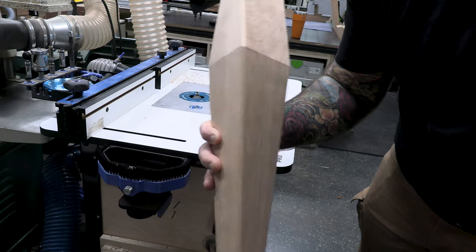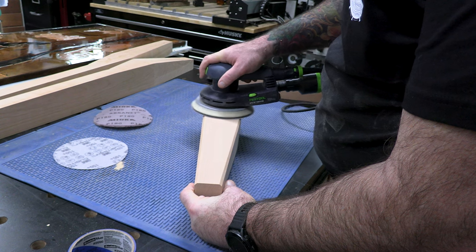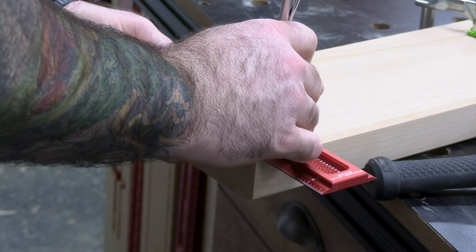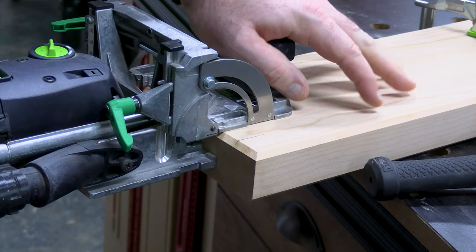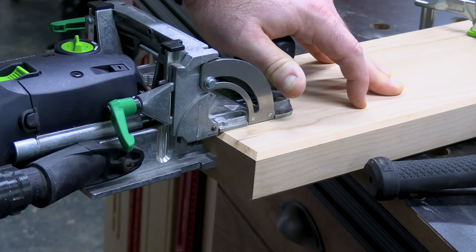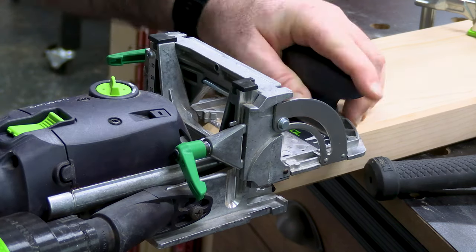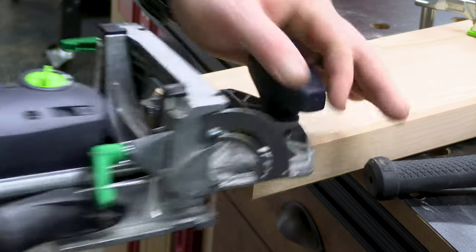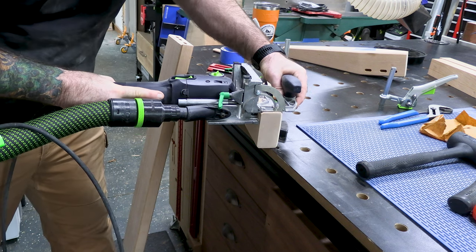You can see what I was going for with this concept of rounded angles. I took all the legs — each has three tapers total — and put a chamfer on each corner. Chamfers look squared off, but when you start to sand them and round them over slightly, it creates that rounded angular look I was going for. I wanted the edges to be rounded angles, and the tapers not super sharp — leaving me with a really cool looking leg.